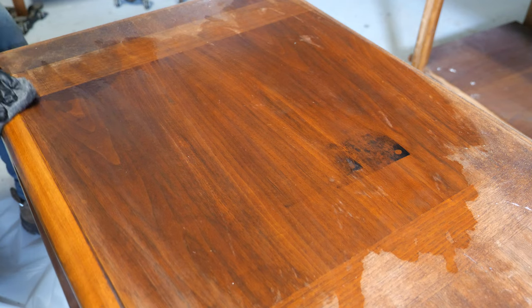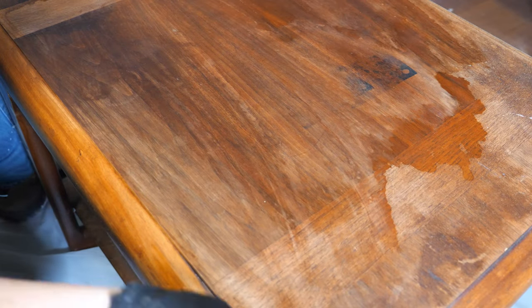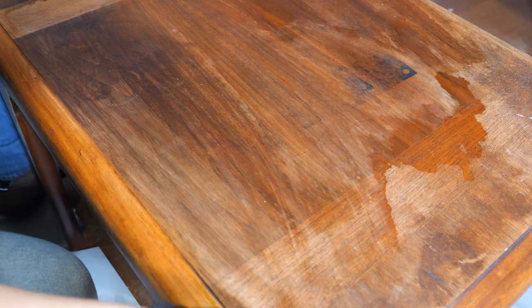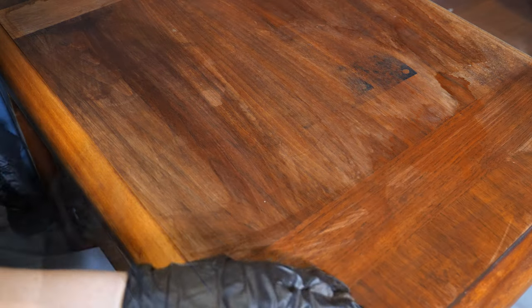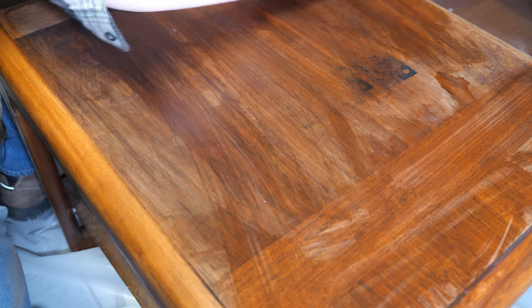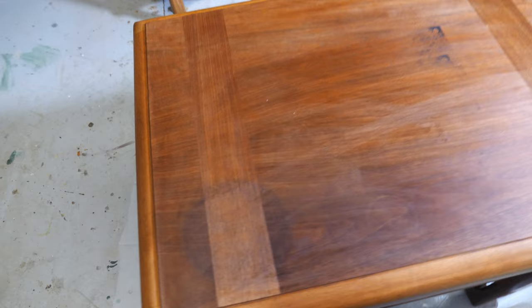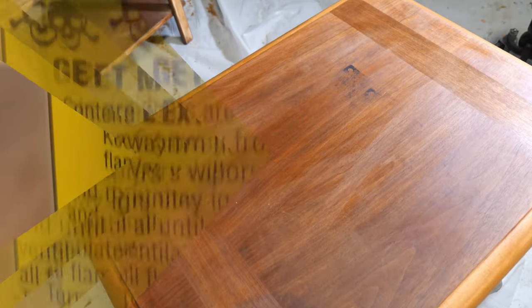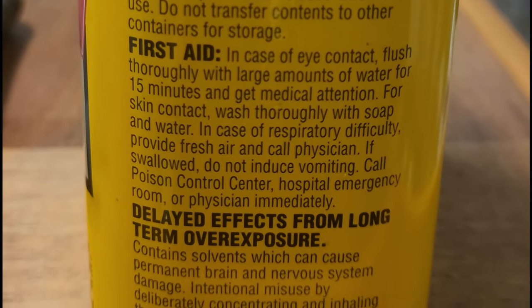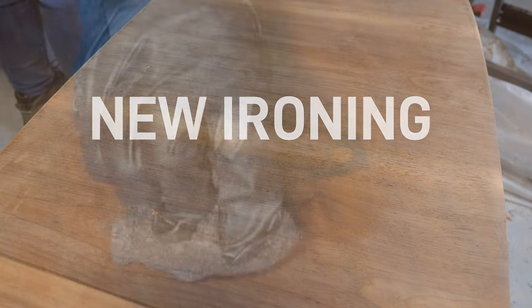You're also going to need very thick chemical-resistant gloves, or you'll need to double-glove. The product is easy to use — you just use super-fine steel wool soaked in the product and apply it to the furniture piece, then wipe the substrate with a clean piece of steel wool. However, I went over the entire side table twice and still felt like there was a thin layer of finish present, which became very apparent when I sanded after everything dried. It also carries a pretty heavy warning label. My takeaway: I will continue to use this product for small areas and removing tinted lacquer from wood grain, but I have no desire to use it for an entire project again.